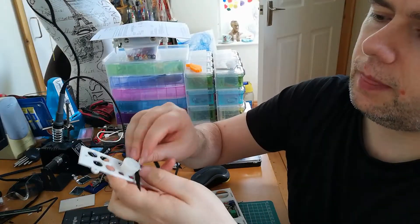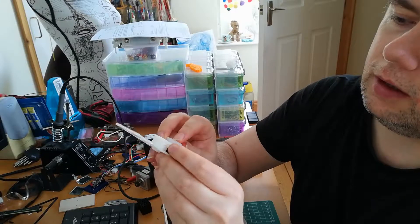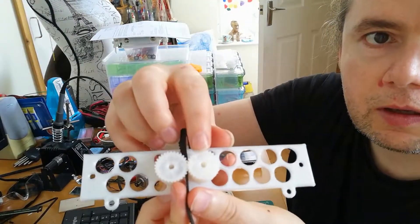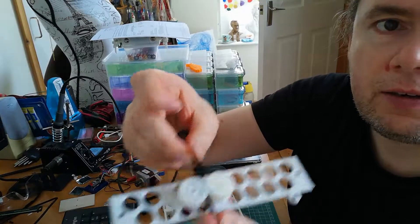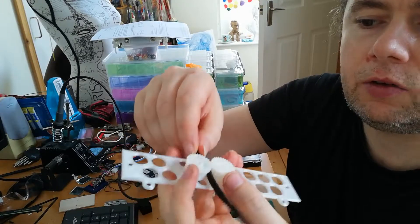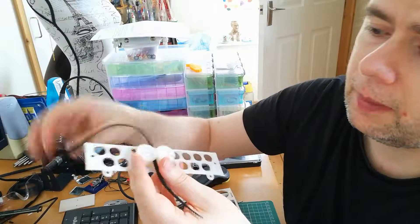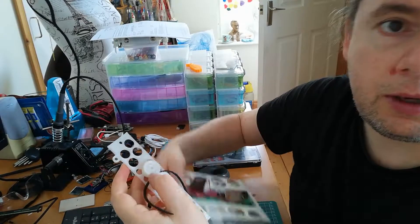It's a bit tricky to get in, but now it's going to be held tightly against another wheel next to it. If you look closely there's a gear on the top of both wheels, so when this turns that turns as well — keeping the belt tight and ensuring it pulls the belt through in either direction. This also means I can run it with teeth down if I want, which solves another issue that was pointed out to me. I'm going to choose teeth down and put this on to see if it works.